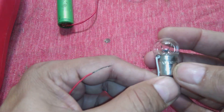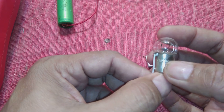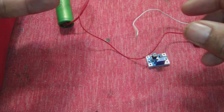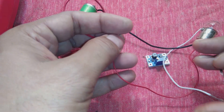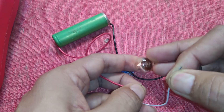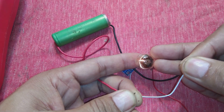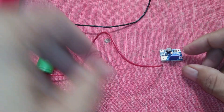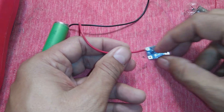For testing, I have a 12V 10-watt DC lamp used for bikes. I am going to connect this to a 3.7V lithium polymer cell. You can see only the filament is barely glowing at 3.7V, but at 12V it will glow very nicely. So we will step up this 3.7V DC to around 12 or 13 volts.